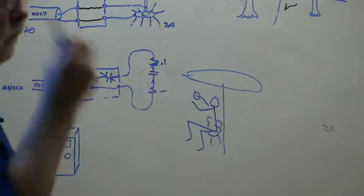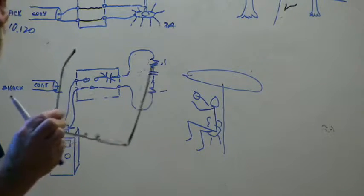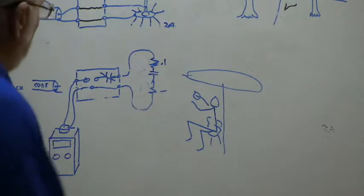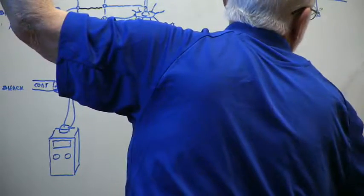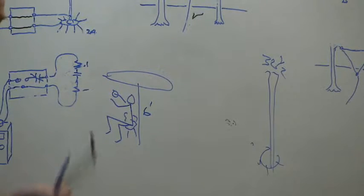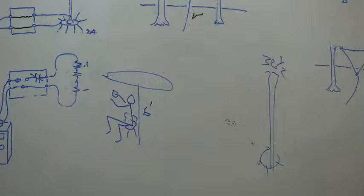Jerry Sevick, the guy that developed the transmission line transformer, did a lot of work with short verticals. And he had a picture in CQ that had a 6-foot vertical on 40 meters. Behind his house, he had his regular vertical, which was 32 1/2 feet, and had the radios and all that. His wife was in a lawn chair under what looked like a beach umbrella. And he was making comparisons between his 33-foot vertical and the 6-foot vertical. And he found that 97% of the time there's no difference whatsoever.